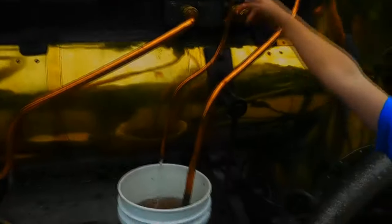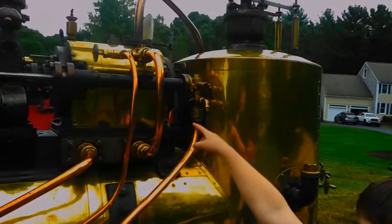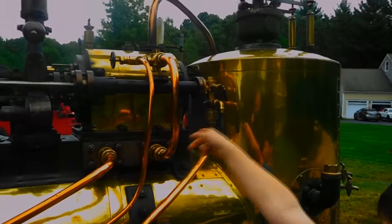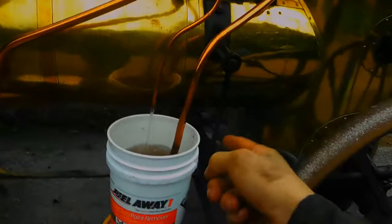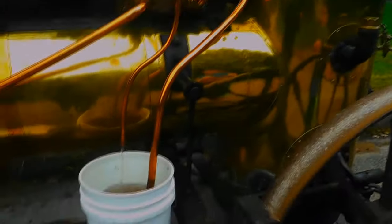This one connects to that and it goes down. Up there, or through there — up and then back down. Which direction is it going? And then remember what happens when you close that valve up there and it can't go down that pipe anymore — what happens then? It sucks up the water. Where does it go? Into the steam. And then where does it go? Into the boiler — goes in the heater, goes through it, down to the check valve and into the boiler.